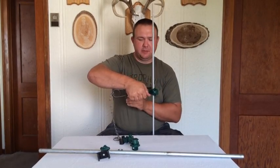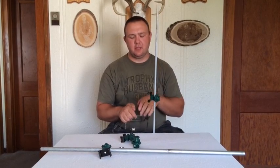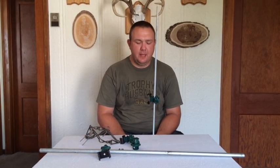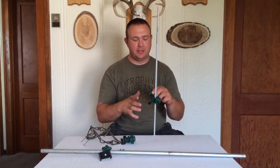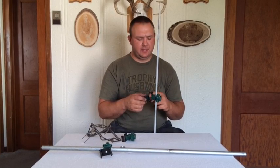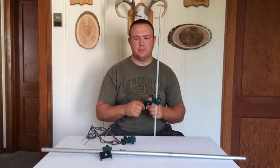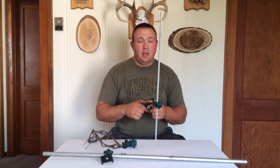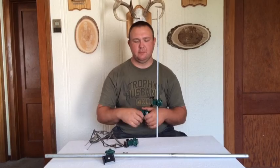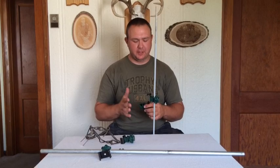We looked into a lot of different designs when we were molding this product. We wanted to go with a plastic piece but we couldn't come up with a plastic that would maintain its strength and form over a long period of time. We also looked into doing a stabilizer that clips rigidly without rotation, but without the spring steel and the flex we couldn't get it to fit all the body grips on the market. So the main goal is a good body grip stabilizer that does multiple uses and multiple pulls.